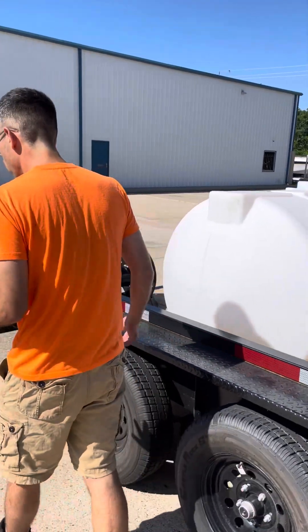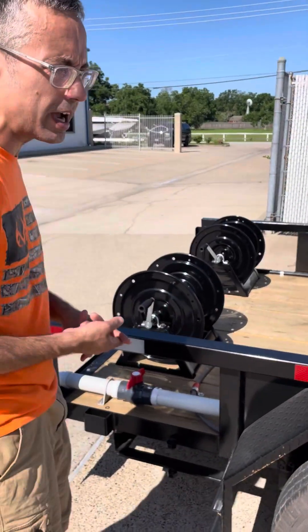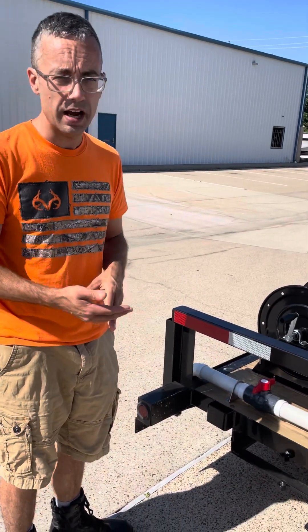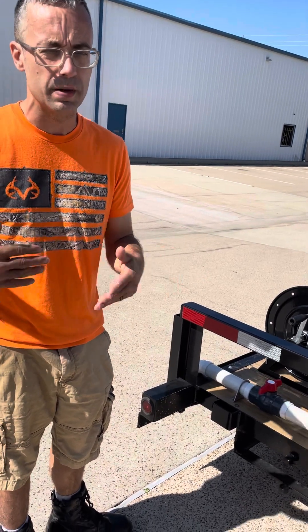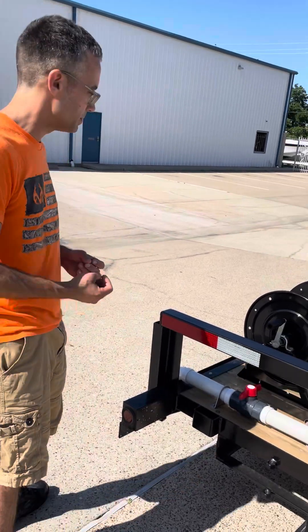Keep in mind that if you're in North Dakota in wintertime, you're probably not going to get that. I believe it's a 110 degree temperature rise, and that particular burner puts out 385,000 BTUs. The SDC burner has 555,000 BTUs and gets more like a 130 to 140 degree temperature rise, just to give you an idea for people that are numbers-oriented.